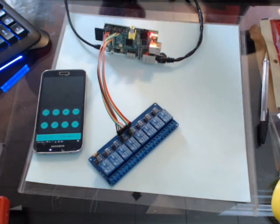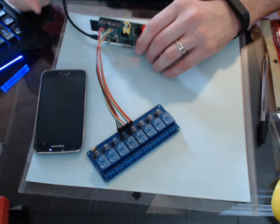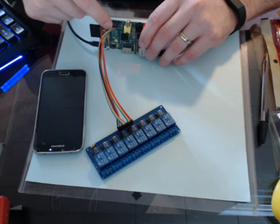And then I start to use the GPIOs that are available. I used this list: GPIO 14, 15, 23, 24, 25, 8, 4, and 17. When you look at a pin out you'll understand what I'm connecting to. Connect from this side over to here and you should be good.